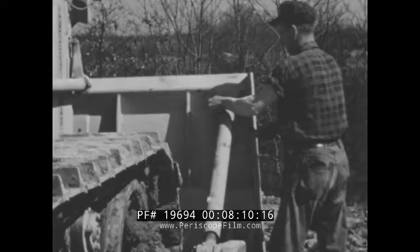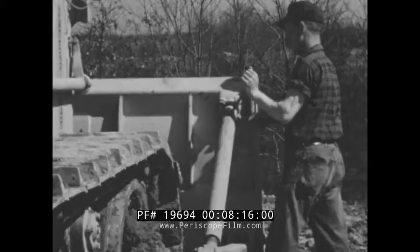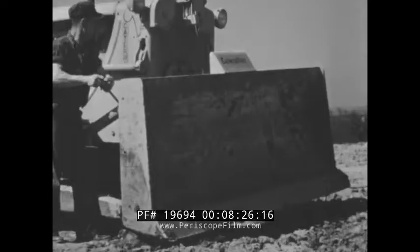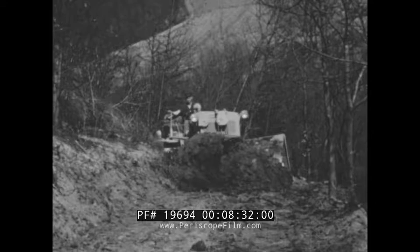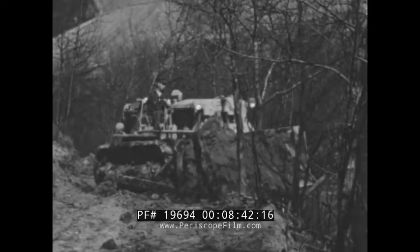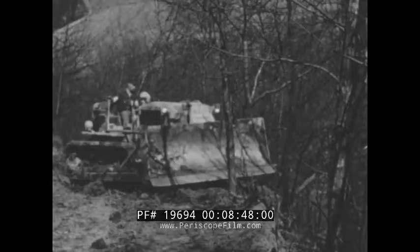Now a different problem is presented. A side hill road is to be pioneered with the right corner of the blade working next to the bank. That corner is lowered up to 12 inches if need be by shortening the upper diagonal brace. The threads on this brace are completely enclosed and copper-plated for easy action and protection from rust. Most of the digging is done on the bank side, which safeguards the road against cross-washing and keeps the tractor against the cut.